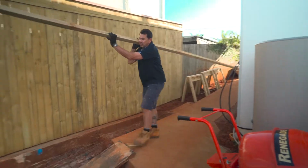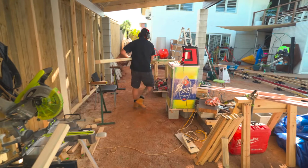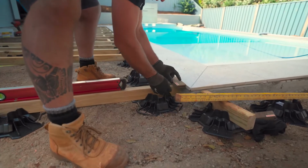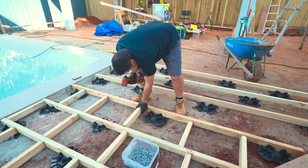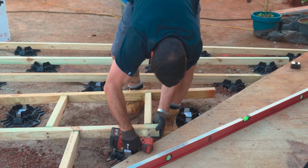The process for building straight into the joist slots is fairly simple. Measure a row at 450mm centres and then cut the joist to length. That's pretty well the height I'm looking for. In this case, he's adjusting the height by slightly adding or removing aggregate. The bridging between joists adds additional strength and stops the joists from bowing.